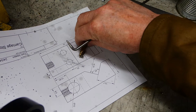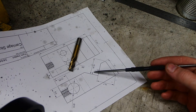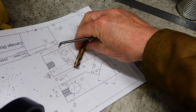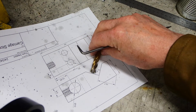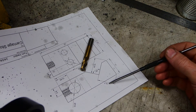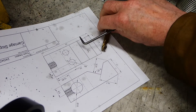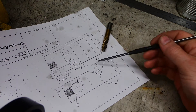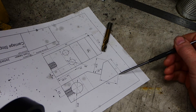Then I'm going to move the milling cutter across, get it out of the way of the part, and bring it down 16.34 millimeters — that dimension plus the 0.1mm of the feeler gauge I'll use to edge find. That cutter will then be at the correct depth to cut the bottom feature, then I'll move the cutter along cutting away to make the groove. That face needs to be 15.7 millimeters away from this corner, and I'll be able to measure that distance with the micrometer as I go, so only those two dimensions are needed on the drawing.